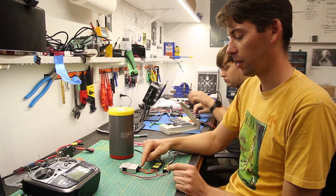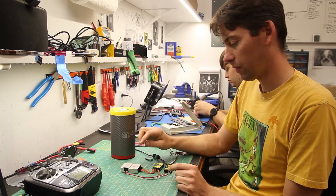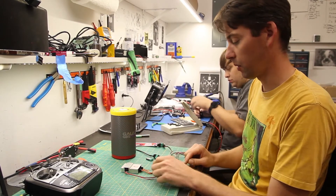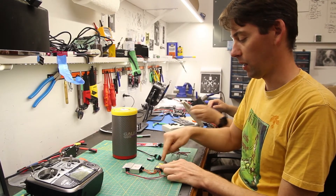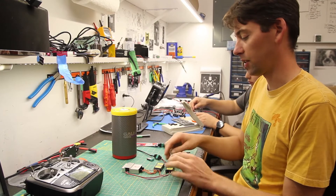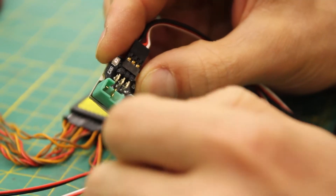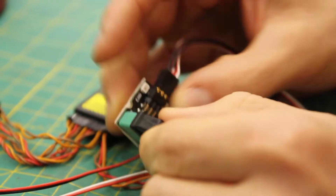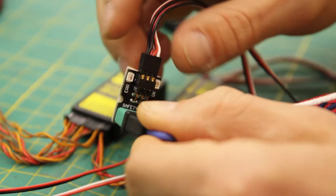It has an engine cutter system that takes all of your motor inputs from the flight controller and has the ability to shut them off. So you have an in and an out for all your ESC plugs. I don't have the ESCs plugged in. And then you have a nice little remote mounted plug, a remove before flight plug. You'll get a confirmation LED whether the system is armed or not, and it will be armed when you pull the plug.